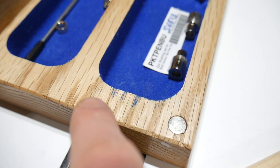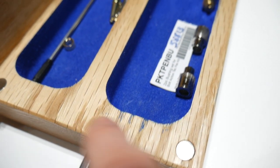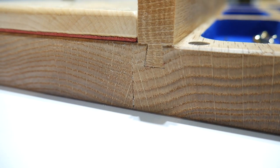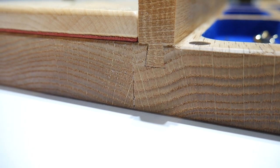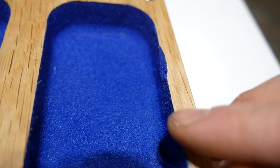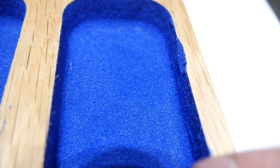If you made it this far in the video, thanks for watching. I'm going to be adding this portion to the end of my videos — it basically reviews some of the mistakes I made and how to fix them in the future. First one I mentioned before: be sure to tape off those areas where you're going to do the flocking, because even with the template attached you can see it still spilled over in some areas and they were almost impossible to remove. Next thing: clear out the waste for a sliding dovetail joint with a straight bit first — this is common practice but I didn't know it at the time; it would have saved a lot of stress and probably made it cleaner. Very last thing: when routing out the compartment profiles, I would often have to remove the router to clear out the dust — I kept the router spinning while removing it and would sometimes accidentally nick the edge. Be careful to stop the router before removing it from the compartment.